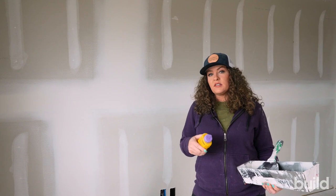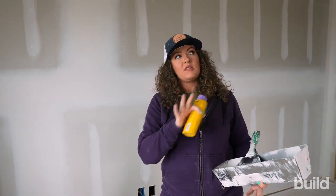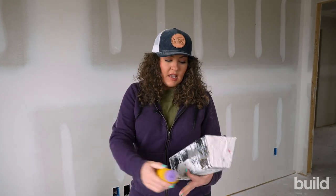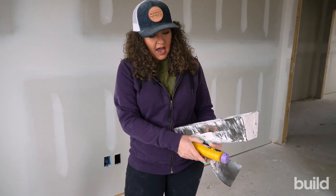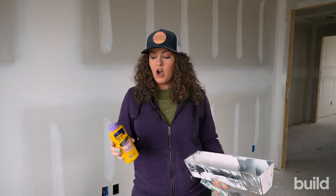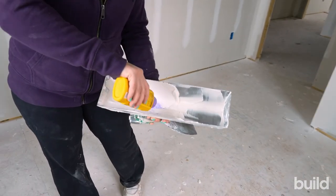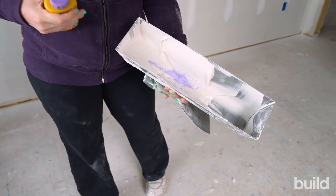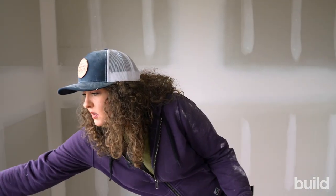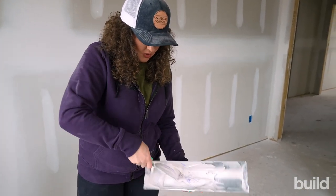So when we color the mud, it makes it easier for us to find that spot later on and to make sure that we are not missing spots. And you know, you've been in a room where you can walk in and see your colored touch-up kind of jumping back out at you. An important thing about using touch-up pigments is this mud, by itself, it's soft. Once we start adding chalk or additives in there, it will change the consistency. So it's very important that you are not dumping in too much chalk — if I dump this whole bottle in, it's going to make this mud a lot harder than the mud that's on the walls. All I'm going to do is about that much — I could even do less. All I want is to add color and some pigment. Chalk is made of gypsum, mud is made of gypsum, so it's a good thing to add because it has the same properties. Just mix it all up.